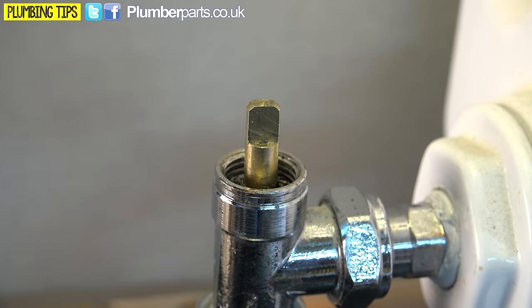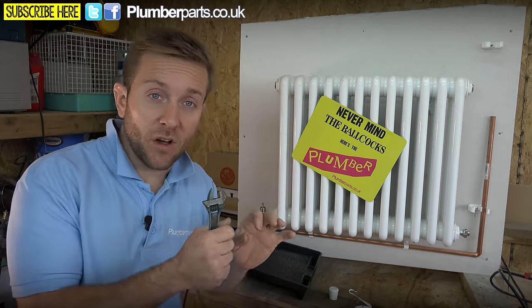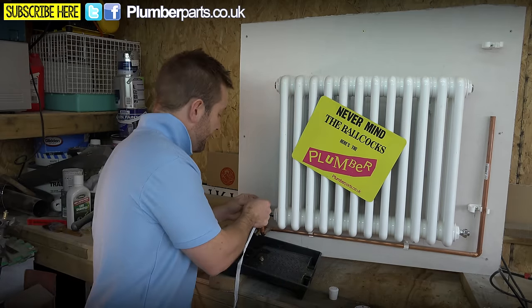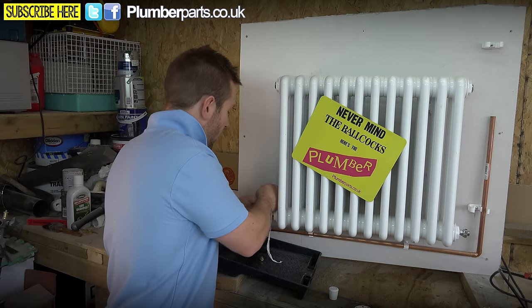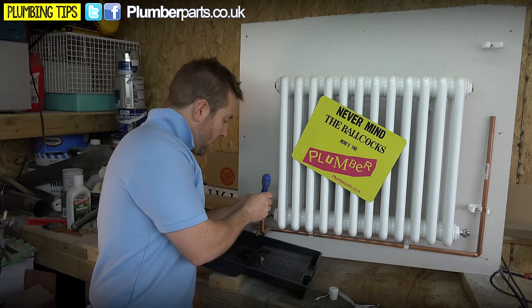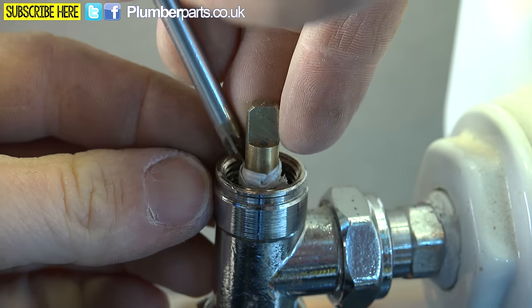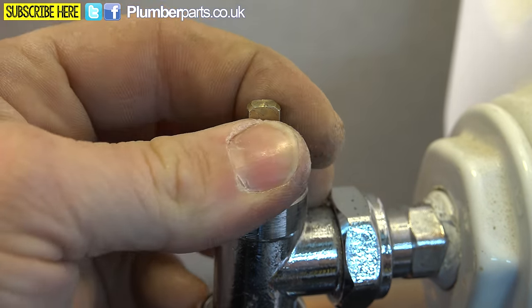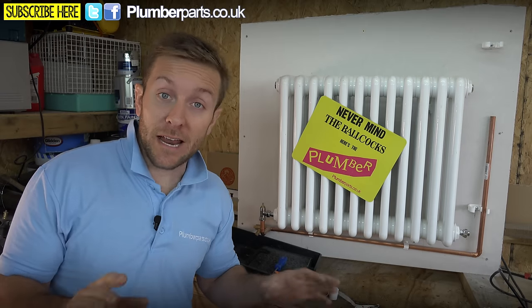Underneath you'll see a little rubber olive. A lot of professional plumbers will have replacement olives and pop them straight in — I've got loads of these little mini olives in different sizes and they're usually the best fix. But if you don't have that, get yourself some PTFE tape and just wrap that round the gland — keep wrapping, try to get four or five wraps on there; if you put too much on it won't work as well. Then use a small screwdriver to poke that down into the gland packing, so it's in there out of the way. Pop your gland cover back on and tighten it up — just a nice little tighten, don't over-tighten it. Then open up the valve again, wipe everything down, make sure everything's nice and dry, test for leaks, and hopefully everything should be okay.